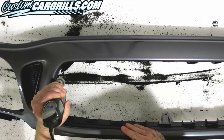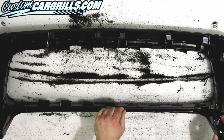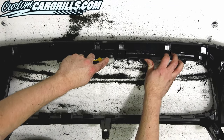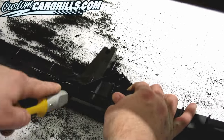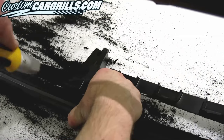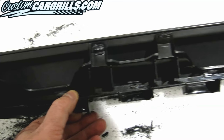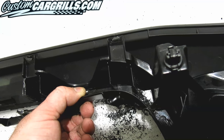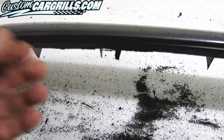While I have cut all the way around the inner area, it's still held together in a few spots. On the back you can see the rim is loose, but they're still connected to supports. The ones on the top and bottom are easy to access with an open-ended saw blade. The upper and lower corners are a bit more tricky, but it's possible with a little bit of patience. The lower center bracket needs some special attention — a simple hand cut like this should suffice. This will complete the cutting of the inner area. Here's a close-up of how the finished cuts should look from the back of the grill. The rim should be detached from the main assembly. The corners, which require some tricky hand cuts, should be free from the mounting brackets that are still intact. With the trimmed rim removed, this is what we have left.